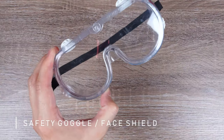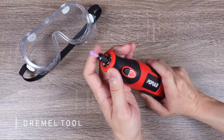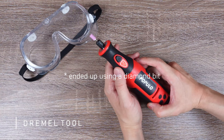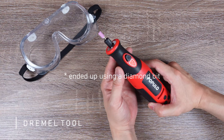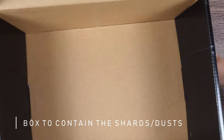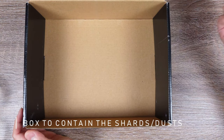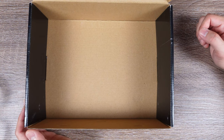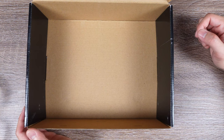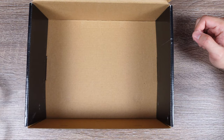Before we start, a couple of things we need: first, make sure you wear safety goggles to shield your eyes, because there might be metal shards flying around. You'll also need your Dremel tool. The bit I'm using today is the stone bit — I've read some people have success with the tungsten carbide bit, but I don't have that. The stone bit is supposed to be good for aluminum. For an additional level of safety, I'm going to work inside a box to help trap most of the shards. My tools and technique might not be the best, so if you're more handy, feel free to leave a comment on a better or safer way.